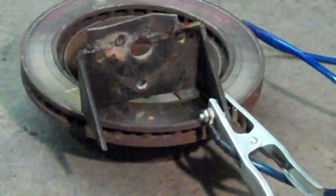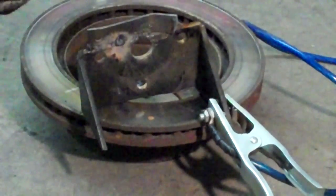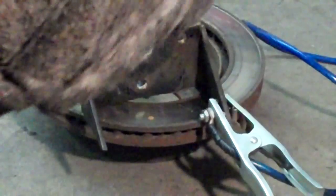This will also show you how these work. You have your ceramic here, and you dump your tip in there. See how it's got a plus and a teeny little hole? See if I can get a good shot of that. So you drop that in there, rattle it in, and then you take the post here, put the spinner on it with the holes to mix the vortex, and we'll put those together. Make sure I get that all in there properly. Looks good. And then I take that and put it into the gun.